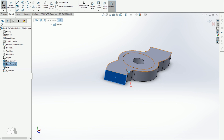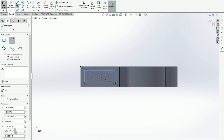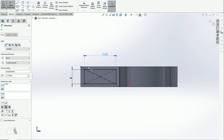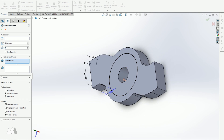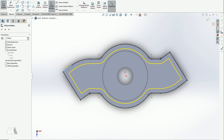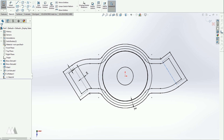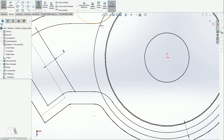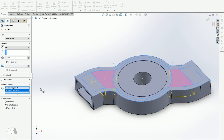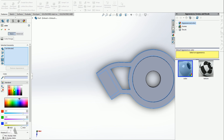Next, I'm going to draw on the end of these arms and create the hole for my USB drive to fit into. I create a centered rectangle and then dimension it based on my measurements of the flash drive itself — that was roughly 5mm tall and 12.3mm wide. I did an extrude cut and a circular pattern for that as well. Then I went back to sketching on the entire body, offsetting the outline and also offsetting the circle, and offsetting the inner cavity part. I'm basically trying to create the shape so that I can cut out as much plastic as possible without affecting the structure of this spinner. I select two specific holes by doing an extrude cut and selecting just those contours, cutting all the way through. Now I have those open spaces that reduce the weight of the spinner, and it looks pretty cool.